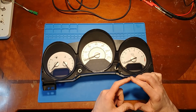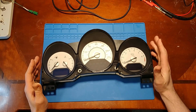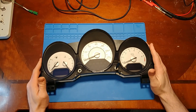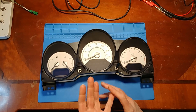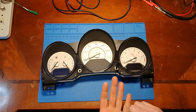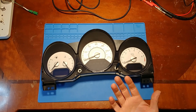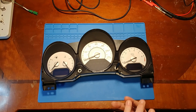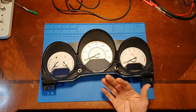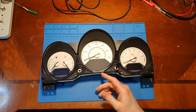Now I'm not 100% sure that I can say the engineers failed and undersized the driver chip, because in my experience what I see after I pull the chip off is some crusty, nasty, dried-up flux crust of a heatsink pad between the center of the chip and the board. The board has four vias in it to help pull the heat away from the chip and into the board. And in all my experiences of pulling that chip off, that heatsink pad looks awful. So we're going to take an extra close look at the heatsink pad after I pull it up and see how it looks.